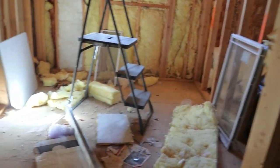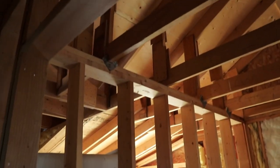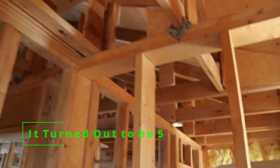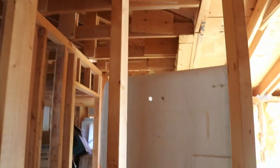Our objective right at this moment is to clean up this room and those two rooms so that we can knock out part of this wall. If you look up here you'll see the trusses — this is actually a support wall, it lends to the structural support of the building. I'm going to take out three of these studs and put in a glulam beam, a homemade glulam beam up at the top, that will act as support for the trusses to hold the roof up.